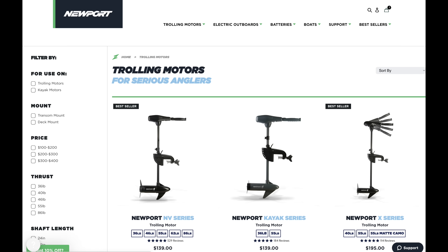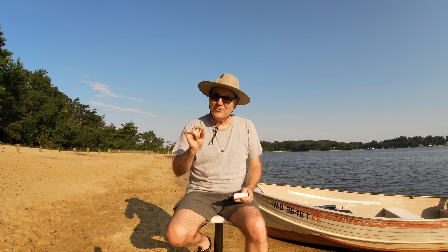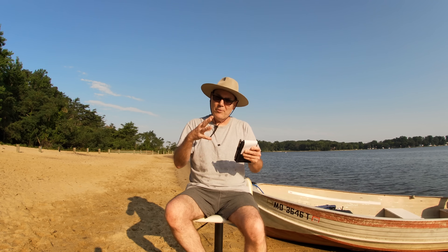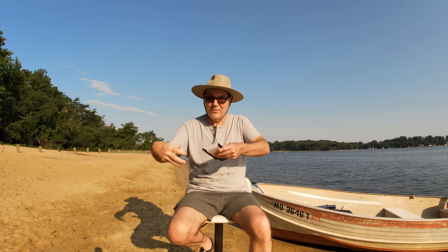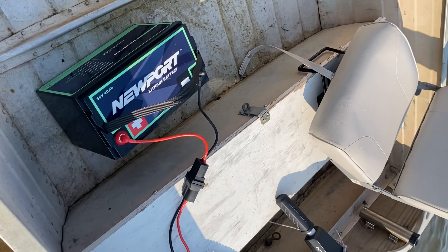Newport also makes and sells trolling motors. If you already have a trolling motor system on your boat that's 36 volts, you can just plug this into that. That makes this future scalable — very easily future scalable. Your Torquedo, E-Propulsion, and Mercury Avatar electric outboards all use a proprietary battery. The Mercury Avatar has one that looks like we'll use with our electric drills, plugging in from the top. The E-Propulsion one is molded into the top of the motor. Torquedo works the same way. This is the only one that uses a block battery you can place anywhere in your boat, and it's cheaper with a battery than the competition — and it's a bigger battery.